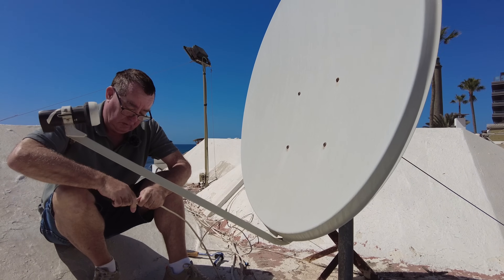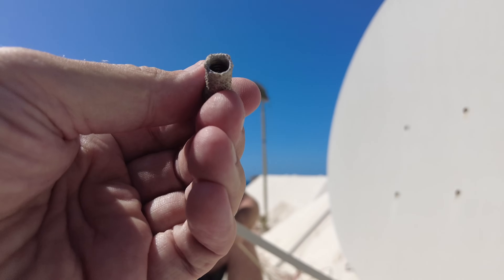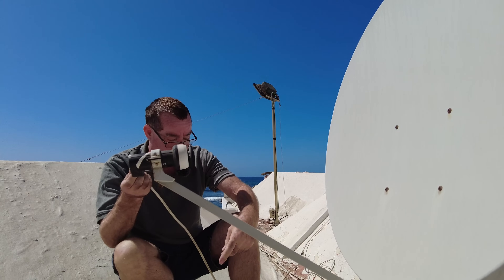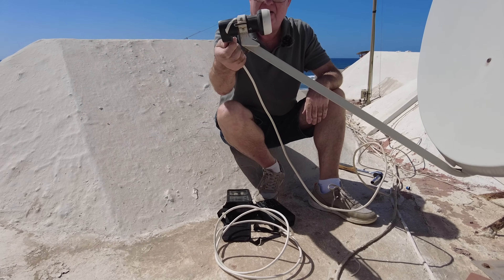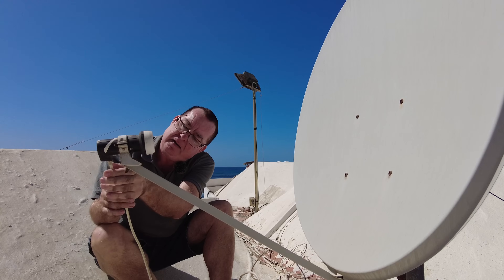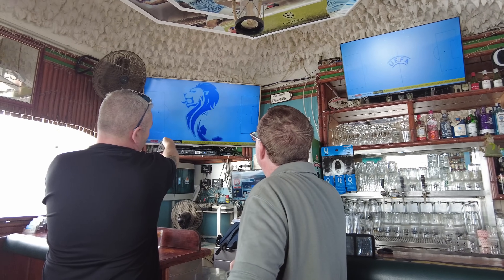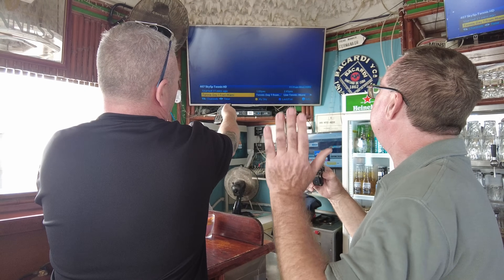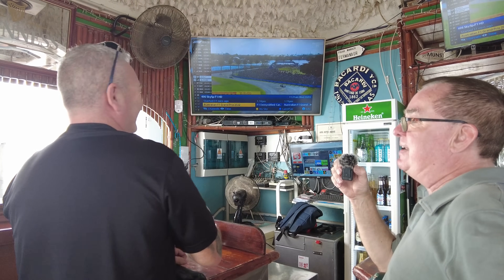We definitely have more signal there. That's been on here 12 months, during which time it's probably rained twice or three times. Short of the sea air — we have a bit of sea over here by the way. Okay, so we go down and see if that's better. What happened here is the actual dish elevation just dropped a little bit, and now it's working fine.